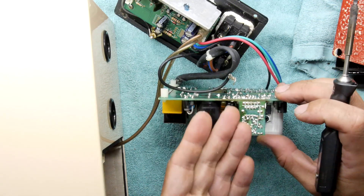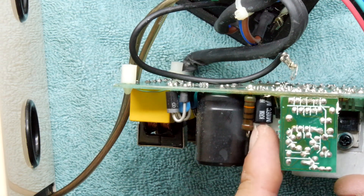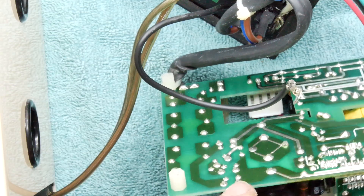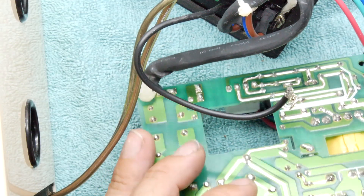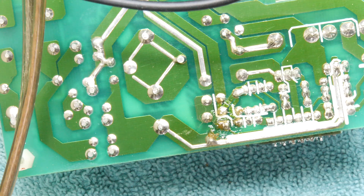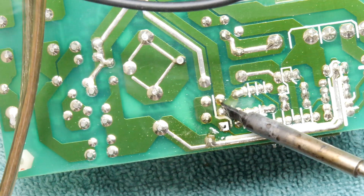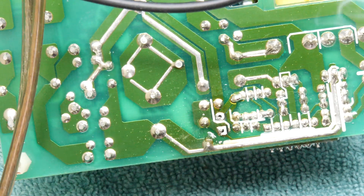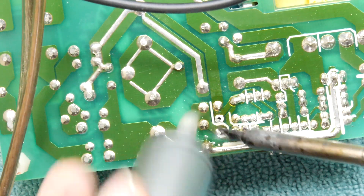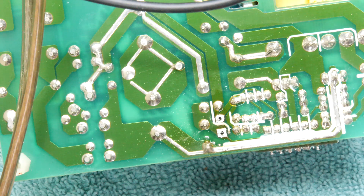The capacitor is right here, so we'll warm up the soldering iron and wham it out. A commenter on the earlier video mentioned that this resistor does get quite hot, and you can see it is quite discoloured. The capacitor basically sits right next to it, so when I put it back I might leave a little more length on the capacitor legs so I can bend it away and make sure it's not touching. I don't think it's worth trying to insulate it, but definitely worth keeping it clear. And congratulations brush — you are now my new flux brush.